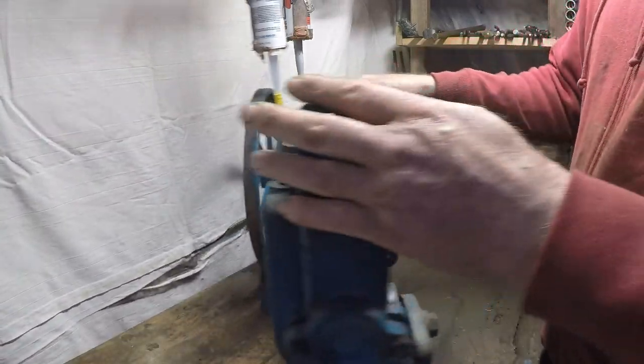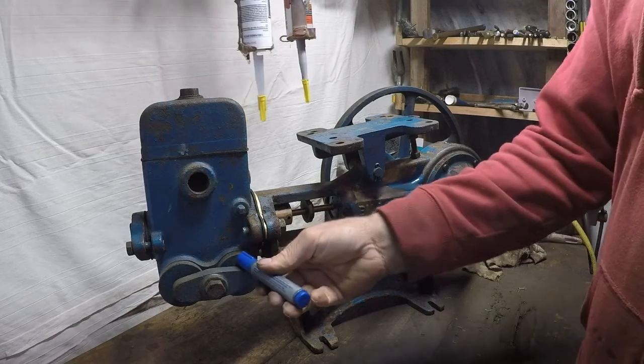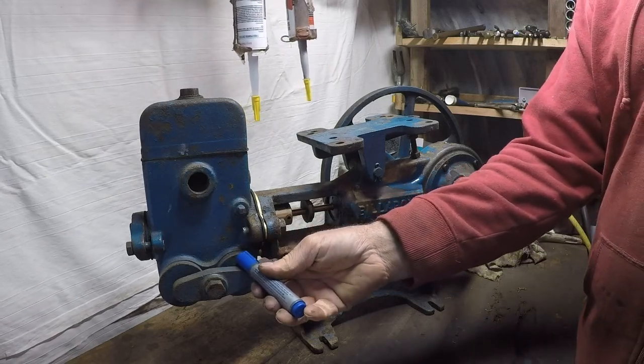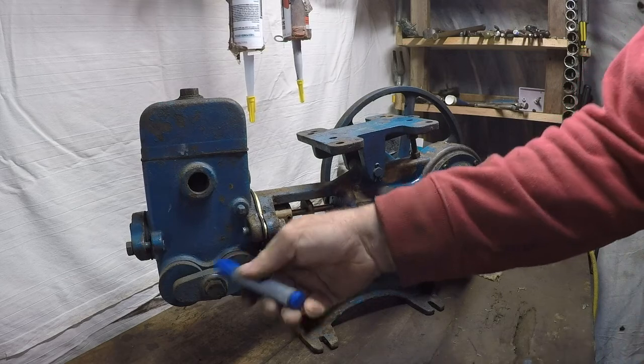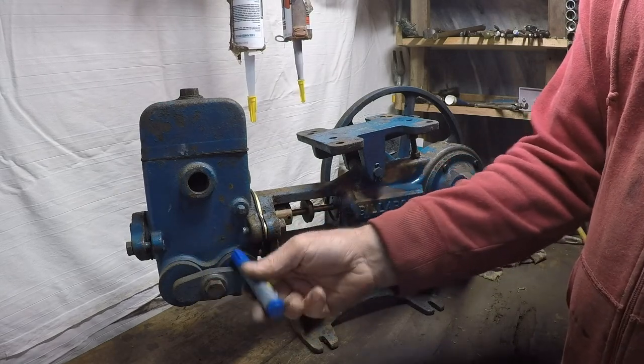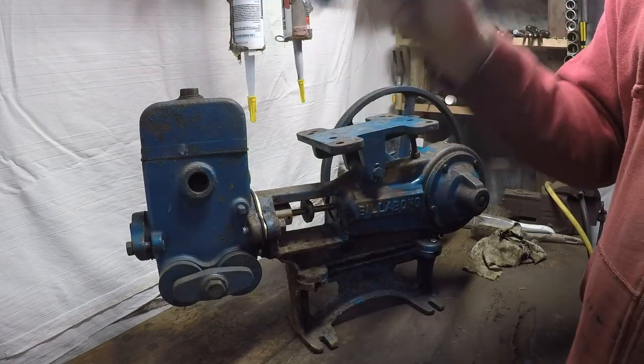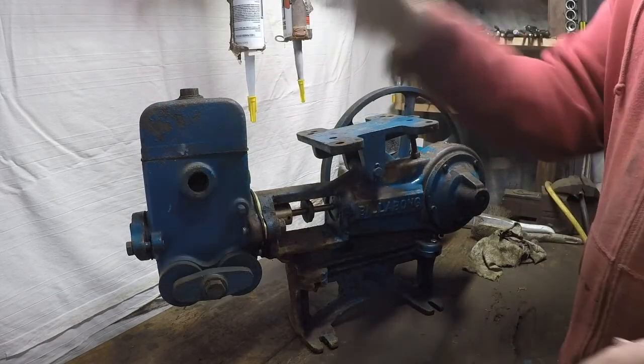Down the bottom, the most common issue I've seen is one of the valves being stuck down or missing. That causes water sloshing around, and it also causes the pump to only fire on one side, so you get a 'squirt squirt' instead of a steady 'do do do do' — just a single one running.